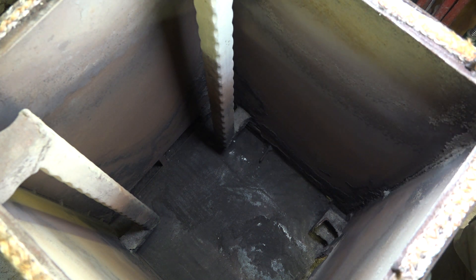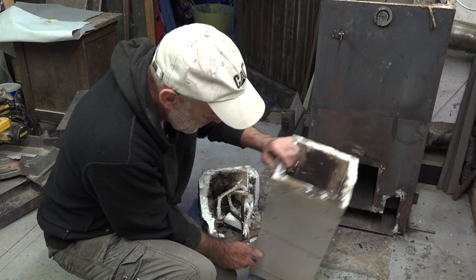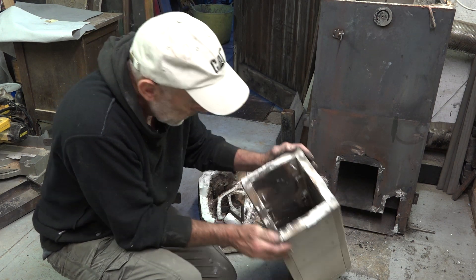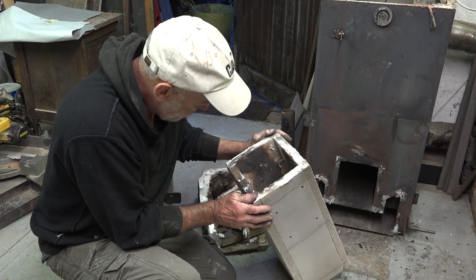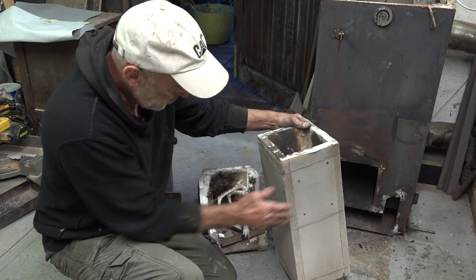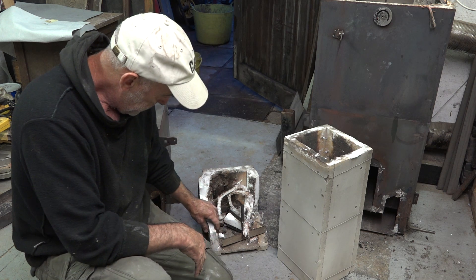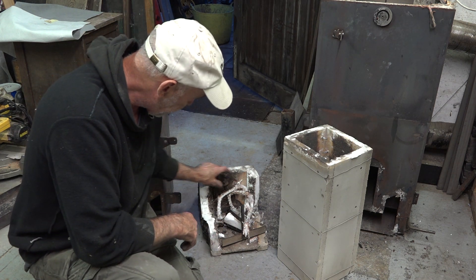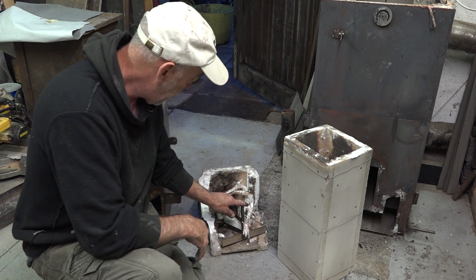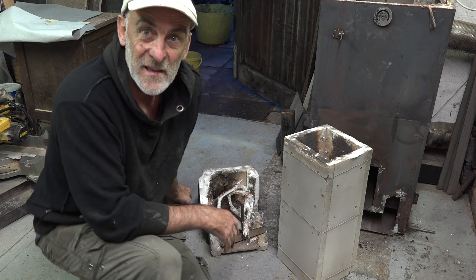It's so easy to fix things. So the riser tube — as you can see it's good, it's great — just those ceramics missing from the corners inside, which I'll replace. But I'll be using it again, it's just going to go straight back onto the base. Good old vermiculite. All that's really failed is just the refractory. If the refractory had been a better grade, I don't think I'd be doing anything to this stove this year other than fixing that back to stop it warping.